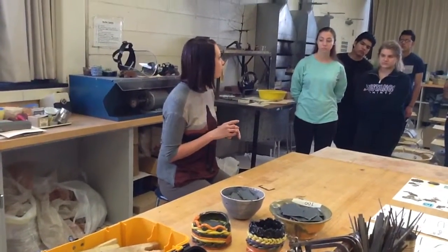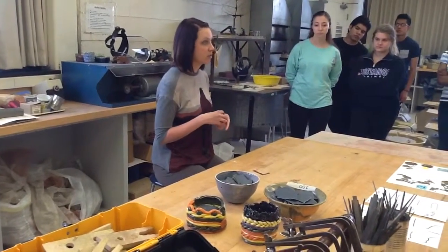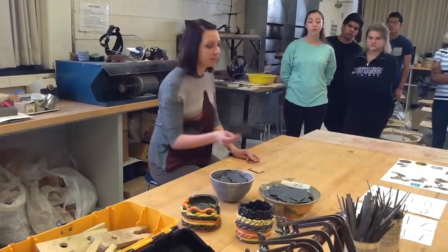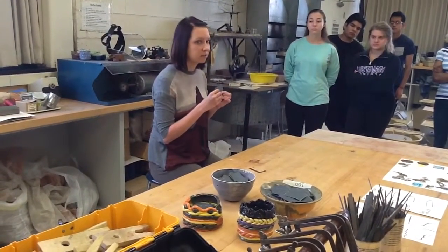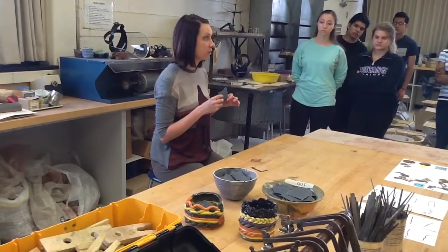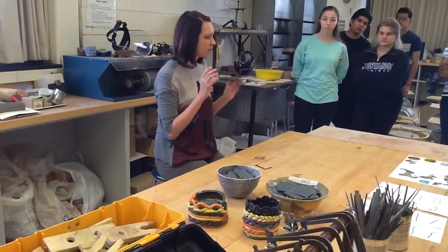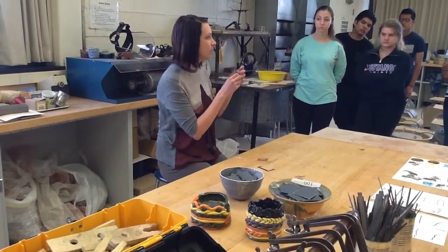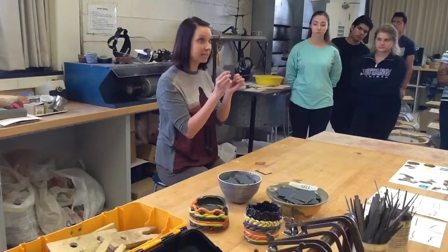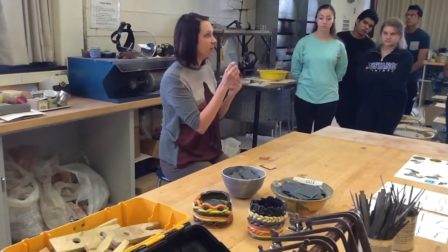You're going to be working with 4 different types of sandpapers. And the different types are just different grits, so the amount of roughness that the sandpaper has. So we have 100, 220, 320, and 400 grit sandpaper. The numbers stand for how many little bumps, how many pieces of supposed sand are within a certain area.